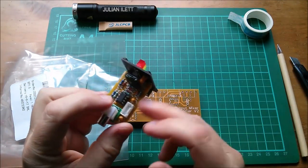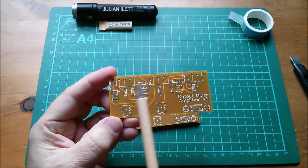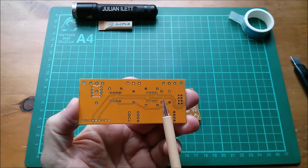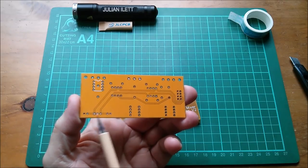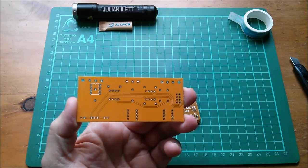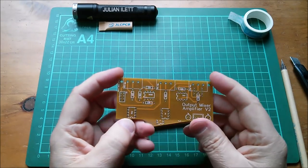This VU meter board is yellow, so it is itself a version 2 board. Consistent with what I've been doing recently, I've put most of my signal traces on the top layer. Most of the silkscreen is also on the top layer because that's where the components are. On the bottom layer I put my power traces — they come from the JST connector, a couple of tantalum capacitors for decoupling, running down to pins seven and four of the op amps. There's also an eight-pin ribbon cable connector, and that's what's new about this revision 2 over revision 1.